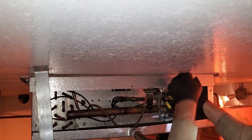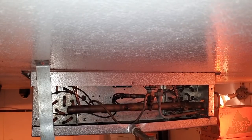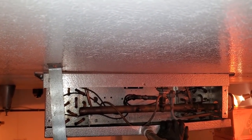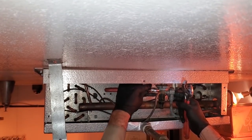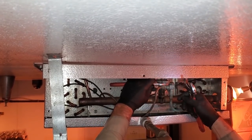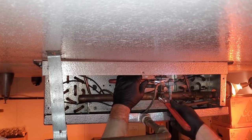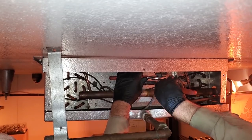When you clip these things, if they're new, you should have to spray on it. I kind of bent the valve just a little bit out of the way so I can get up in here. This one's going to be a little tight because that strainer head is right in my way. I don't think the strainer is going to be plugged up, but we will check that. More than likely I think that our problem is that the power head is just bad.